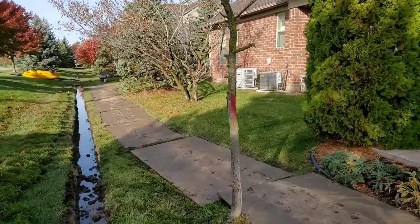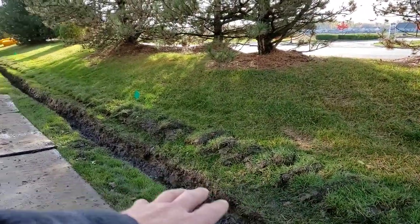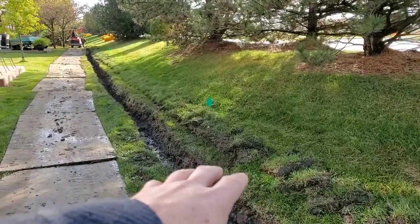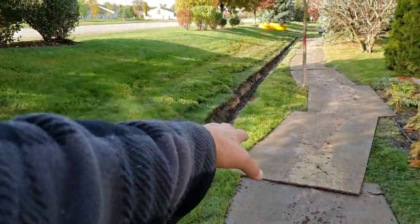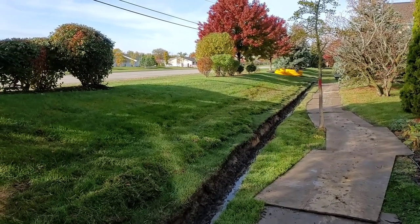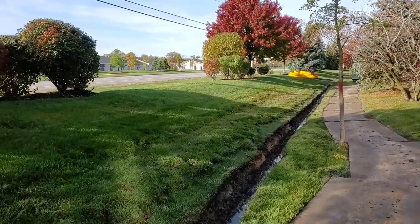This is the high spot of our French drain — we slope it that way and we slope it this way. People don't understand that's how subdivisions are built in urban and suburban communities. Your street goes up and down, and the low points of your street are where the storm drains are.